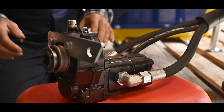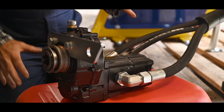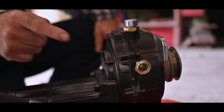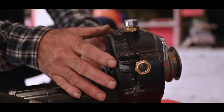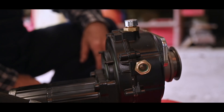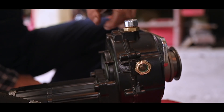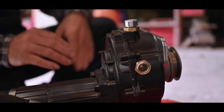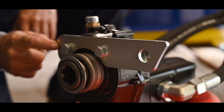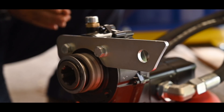Here is the hydraulic pump — a separate unit you attach to the PTO of your tractor. It's a very solid pump with a gear wheel case on top filled with oil, and there's even a sight glass on the side to see the oil level in the gearbox. The gearbox is driven by the PTO at 540 RPM — very typical — and then drives the actual pump at another speed. We'll need to install this pump onto the PTO, and the mounting bracket that comes with it won't fit my tractor, so I'll have to make a new one — that's the adaptation part of this video.